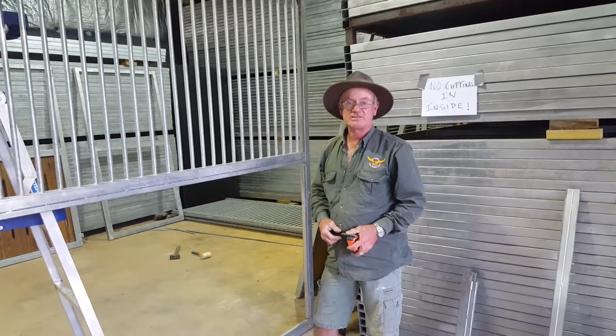I'll actually just quickly show you how to put a feed bin arm in on the panel, and I'll go grab one and we'll show you. Okay, so this is our L bracket for the feed bin. Once again, the 25 by 25 on the outside to match this panel. We have left and rights of these, so when they come, you'll have to match them up. They'll fit in here. And you'll put two screws in there, two screws in behind, two screws in there, two screws in there.